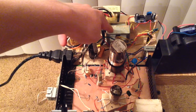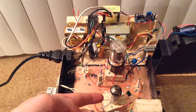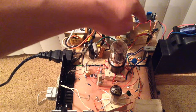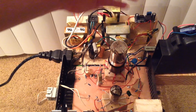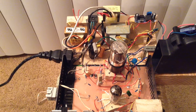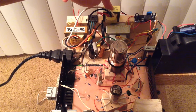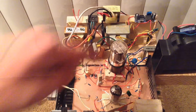Back here I have the filament transformer, which puts out 12 volts. The 12 volts feed the 12AX7 tube, and it also goes to a bridge rectifier and filter capacitor, then to a voltage regulator — or buck converter, as many of you may know it — which feeds the 6V6 tube, because I couldn't find a transformer with an output of 6.3 volts. This transformer up here mainly provides power to the cooling fan that cools the 6V6 tube.